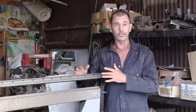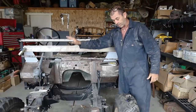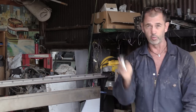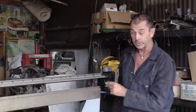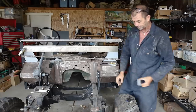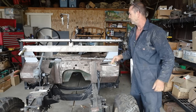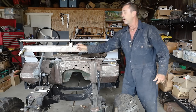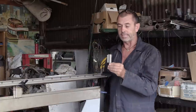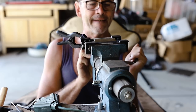So while we are tinkering, what I'd like to do is understand how the vents are going to fit together. What we have here is the top rail — I'm calling this the central panel — and the original central dividing piece lived here. I was hoping to restore that but I've built myself a new one. Based on the dimensions of this, we've taken measurements on both sides from the top of the pillar post down to this point, and that's where the top of our central panel lines up to. So we take our central dividing piece and put it right there in the middle. Now this, this, and that form three of the edges where our vents are going to fit into. The fourth is achieved by this little zigzaggy piece we've created — it's got some very tight bends.